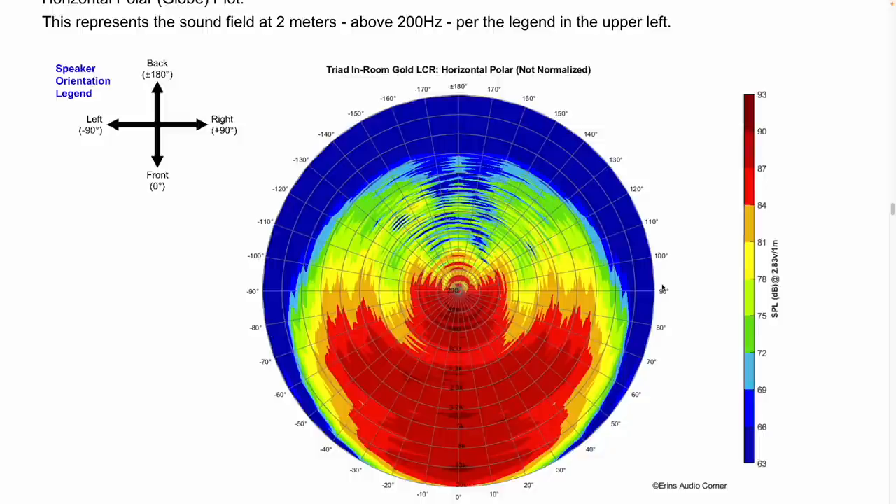This graphic gives us an idea of how much sound is radiated on-axis and off-axis. On-axis is zero degrees; the two 90-degree lines represent the sides of the speaker. Generally you've got about 70 to 80 degrees of coverage through the mid-range on both sides. Above 5 kHz is where we start seeing the narrowing of radiation — one is the on-axis diffraction dip, and the other is the narrowing of the dome tweeter response itself. One-inch dome tweeters typically start narrowing around 6 kHz.